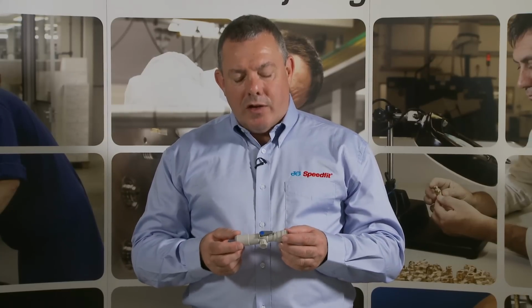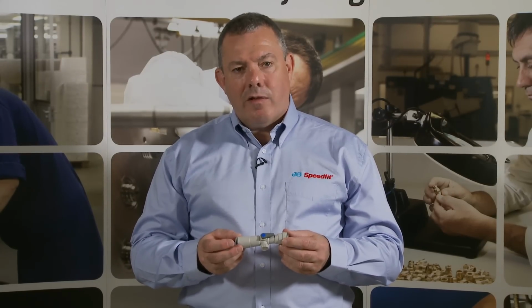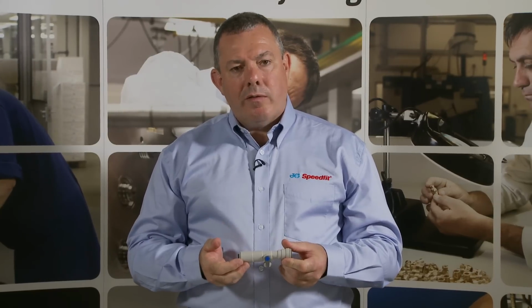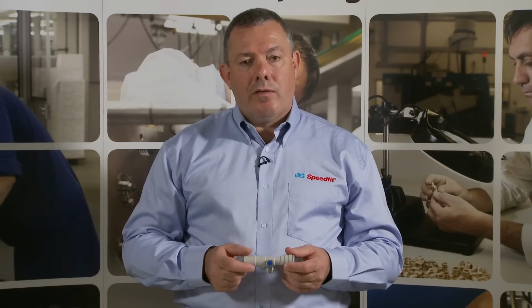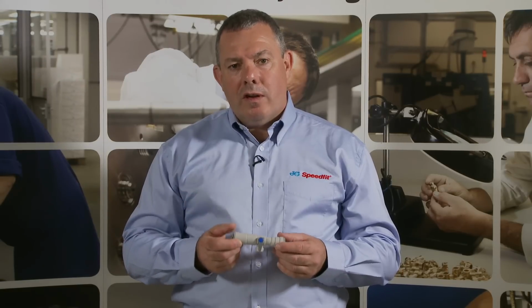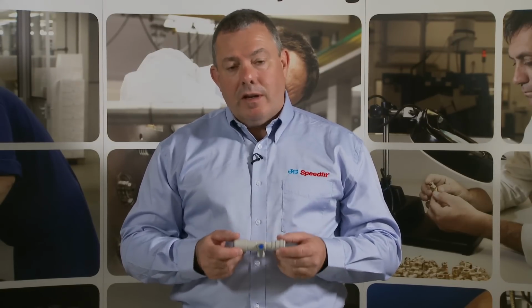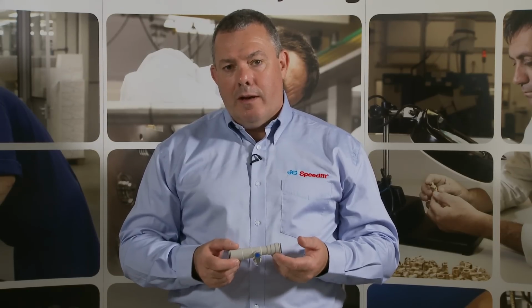This is the item in question. As you can see, it's a double check valve, but rather than having to fit a separate isolation valve, we've built it in for you. So in the winter time, when you need to drain down and shut off your outside tap to prevent freezing, one small, neat, easily installed fitting, and it's definitely space saving. It's a lot neater, it's a lot quicker, and it's cheaper to boot.